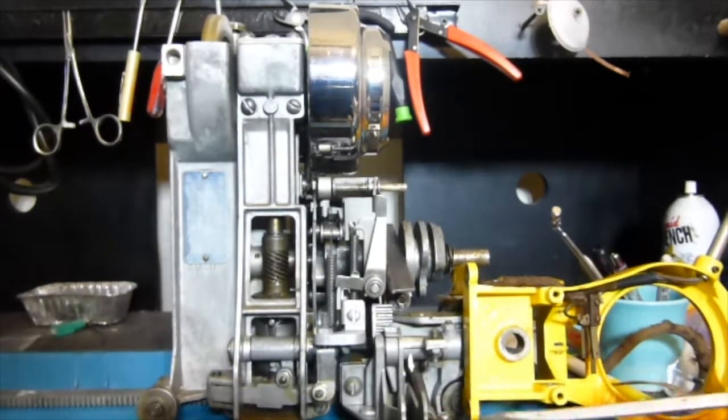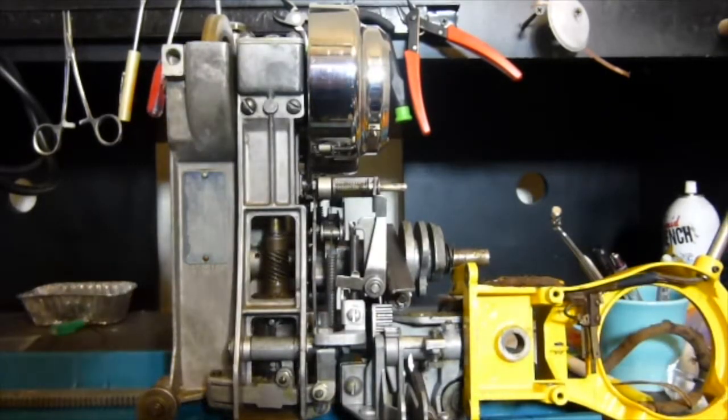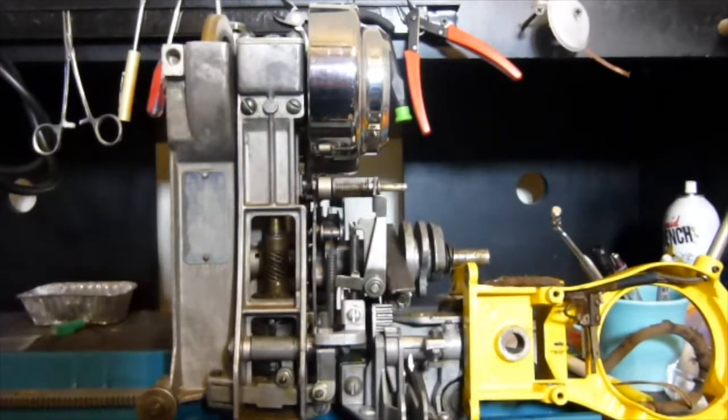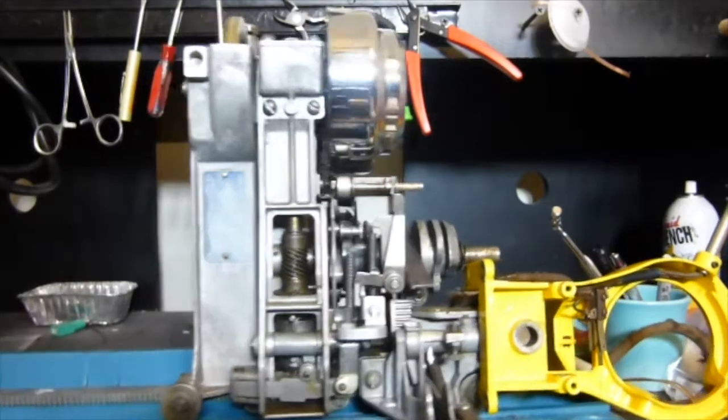But you would not normally want to rethread these wires, unsolder them, or loosen them this way, because that would mean unsoldering the selector indicators or the frog and loosening the wires. And you can do what you need to do with the turntable without taking the stripper plate all the way off. Okay, so let's go ahead now and take a look at the turntable.